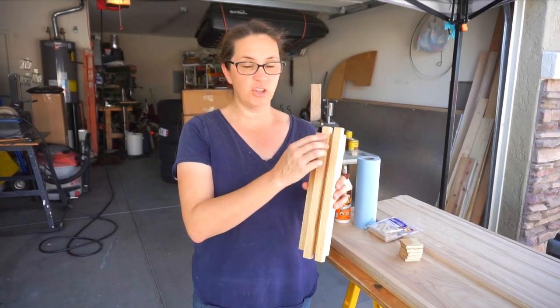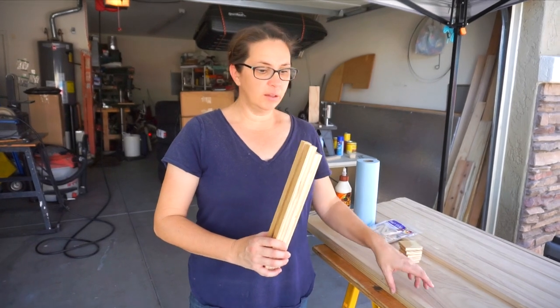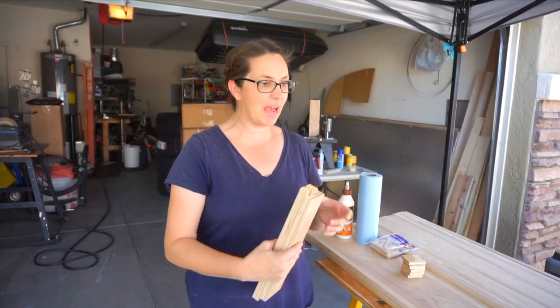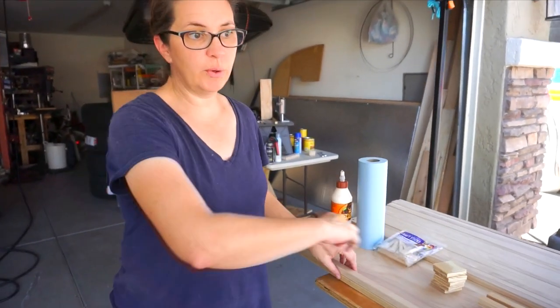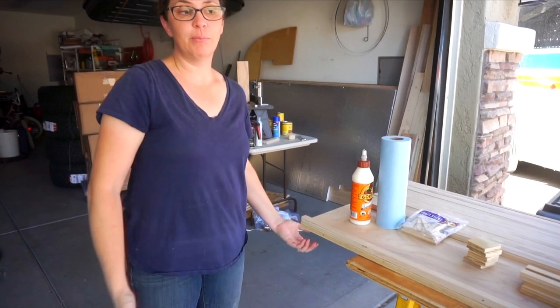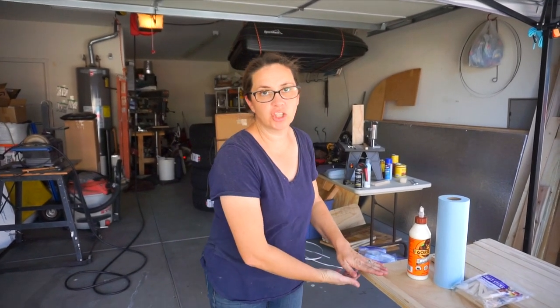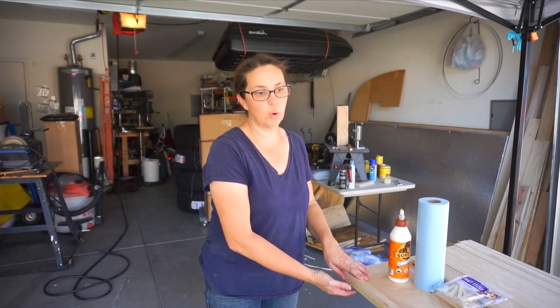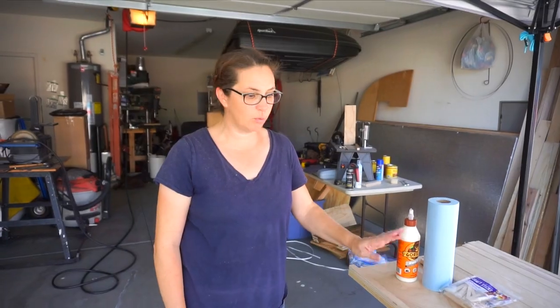We obviously really don't like the look of that. We just want to use the wood glue, but while it's setting up it'd be nice to have it nailed in. So we're actually just going to do it from the backside — as we're gluing these big strips in and clamping them down, we're just going to shoot a brad nail in from underneath, because on the backside, which is actually going to be in the bathroom, we're going to have another very thin layer of plywood — quarter inch — on the backside to do a fun project with. That'll all get covered up anyway. So our plan is to glue, clamp, and brad nail from the back.